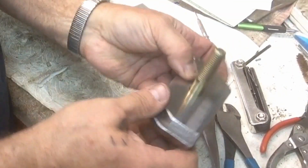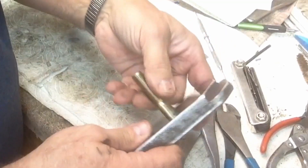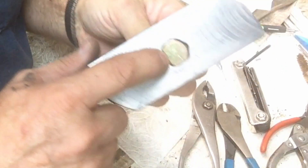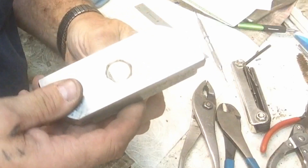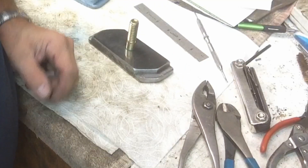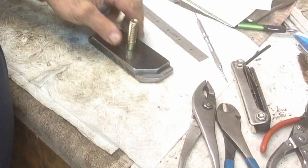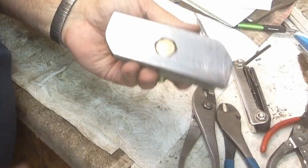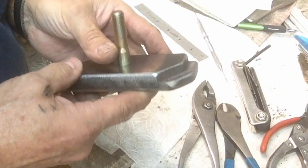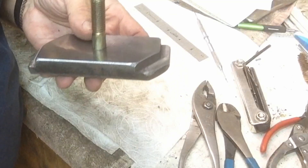Here's our part, pretty well deburred and cleaned up. I think it's about as cleaned up as I'm going to get it. I've got my bolt in there - I ground it so it fits down in, and I'm just going to hit it with a TIG weld right there just to stop any possibility of it coming out. We're below flush there so it'll allow it to sit flat. We're going to apply a tack right there and then we'll probably go ahead and powder coat it - quick and easy. We'll sandblast it and throw some powder coat on it, and this project will be done.